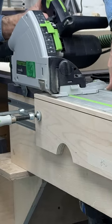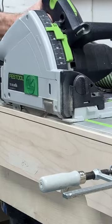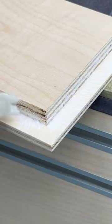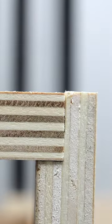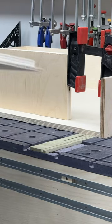A rebate is a simple joint — a square or rectangular notch that runs the length of the workpiece, letting another piece sit into it. It puts the glued surfaces at 90 degrees to each other, and if it's in compression, that lip is extremely supportive and very strong.